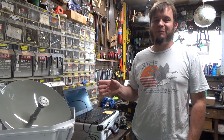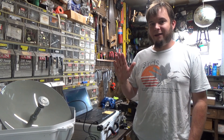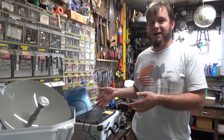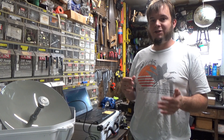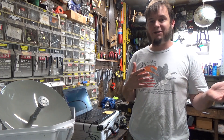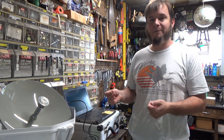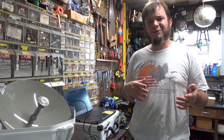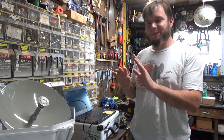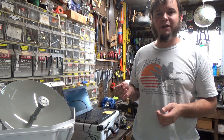So far I don't know what all the onboard commands in this thing's brain can do, but there are some very interesting possibilities. We can definitely aim it, elevate it, and read the RF strength. If I can automate some of that — do a scripted interface to that serial console command system that aims the dish, records the RF, and writes that out to a bitmap — I could do a heat map of the sky. I could potentially see where the satellites are, where there's other RF sources in the frequency range this is looking for. Maybe in the winter when I want to be inside. For now let's go back to the ViewCube and see if we can do some other stuff with that one.